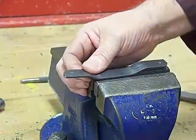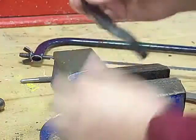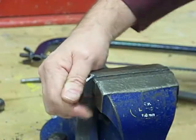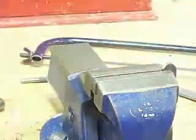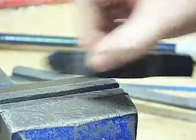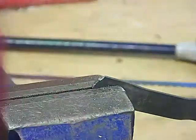I think I'll cut the other one with the hacksaw. Put that in there and we can finish off filing this up — I haven't gone over the line, it's just touching the line, so I'll put that into the vise. Still got a little bit more to come off there. Then as before, I've got to file flat on this side — point that, turn that around, take this corner off.